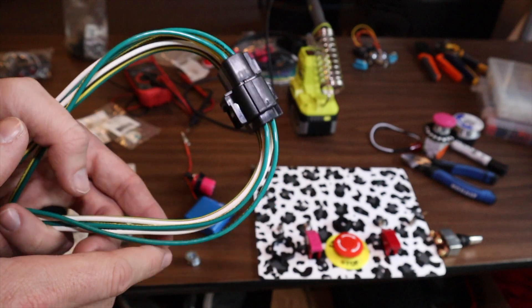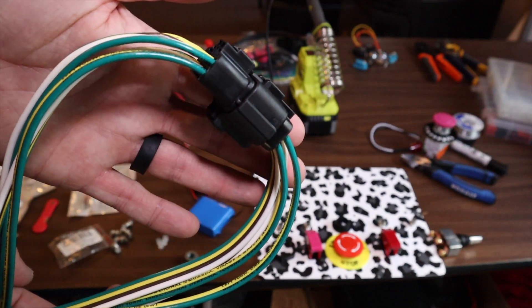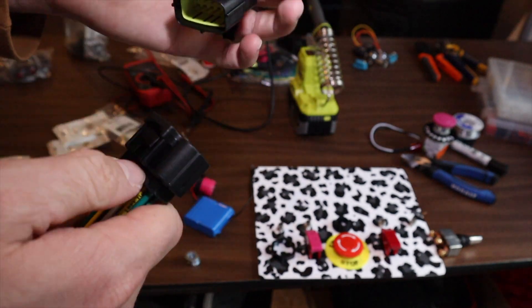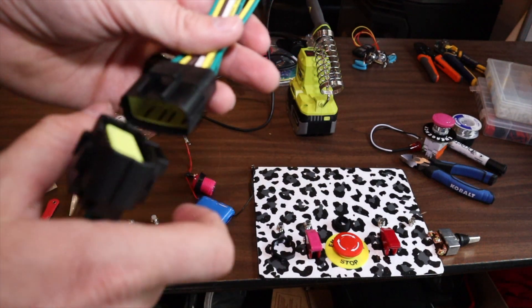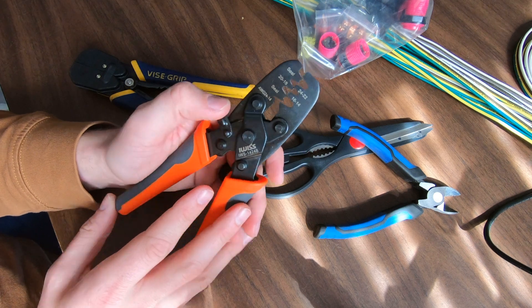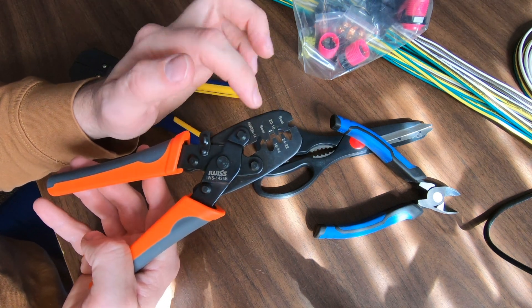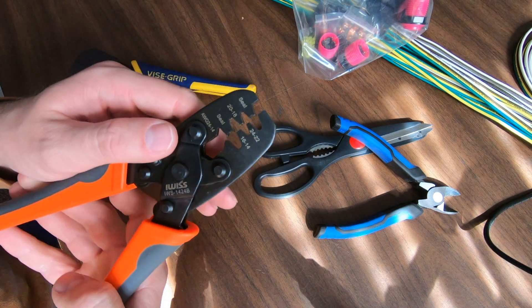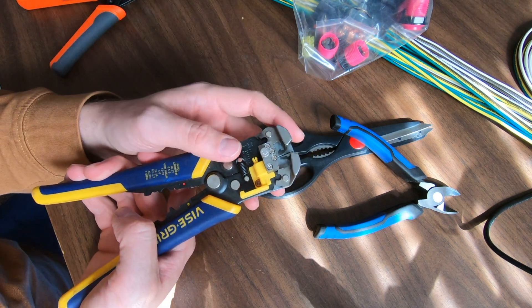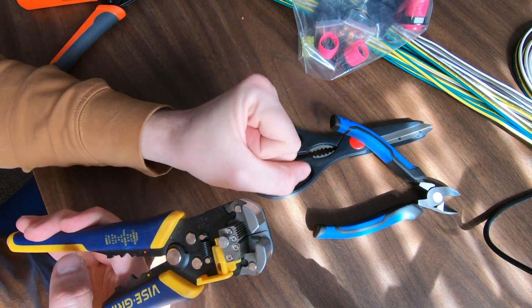These aren't that difficult to do, but you do need two different types of tools. The wire harness is really important to me — I hate wire harnesses where you go to undo it and can't get it apart. This one is so easy to get on and off. Putting all the pins in individually is a bit of a process but absolutely worth it. These pliers here — I'll have them linked in the description — wrap the pins used in the harness around the wire. You can see the different gauges of wire; it tells you which one to use, you crimp them and click them into the harness. And these are wire strippers — I like this style better. You don't need to strip much wire, just enough for the crimp to make a really good firm grab.